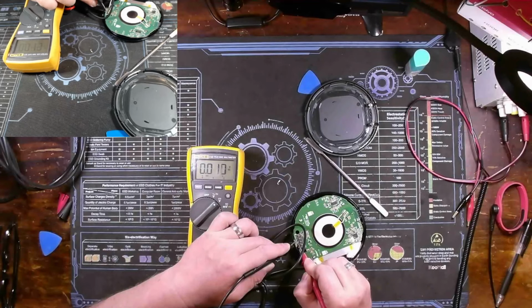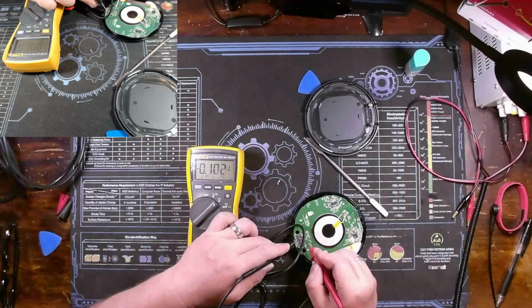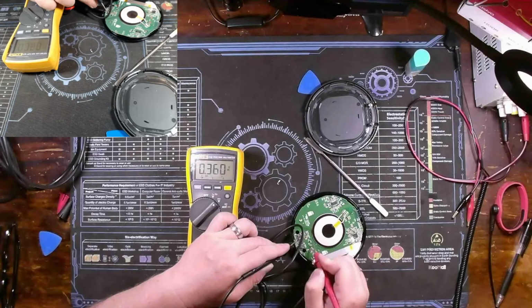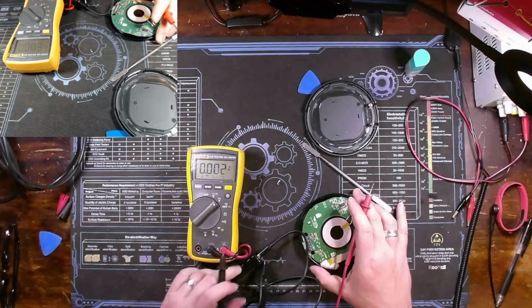Okay, like a filter cap or a fuse or something right there, not too sure. But, yeah, afterwards, looks like we're only getting, like, 1 volt in certain areas. And we got 5 volts on this side going to this right here. Okay, so that's at least a positive. But I'm not seeing 5 volts on my pins anywhere. Diode's not really doing anything. Okay. You would think you'd see voltage on one side of those caps, on one side of the diode.